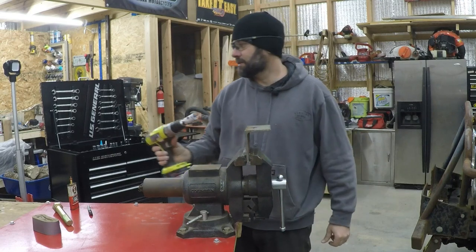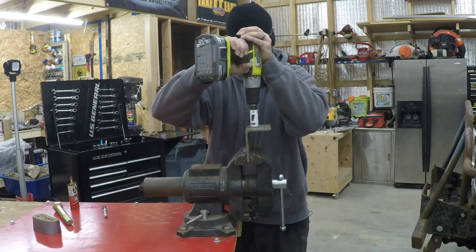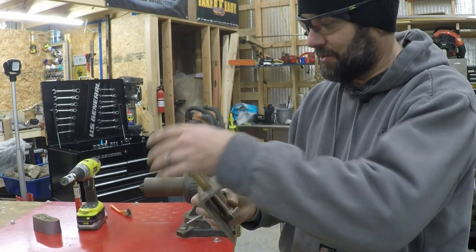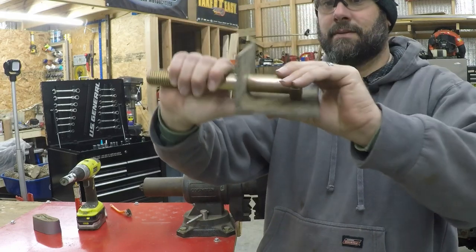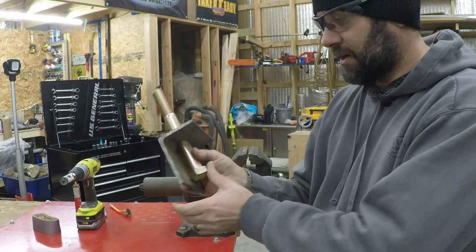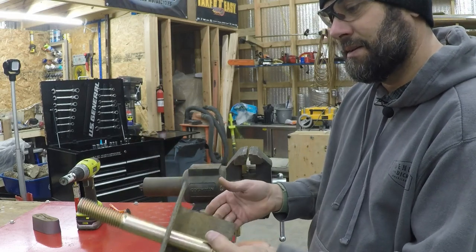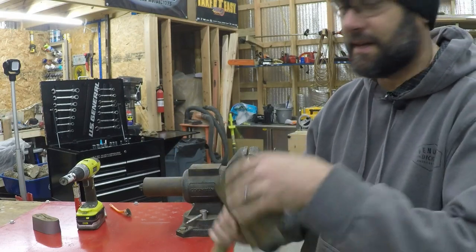It's not looking good so far — this bit's dull as hell. I went ahead and pre-drilled my one-inch hole, so we'll see how this goes now. I measured when I drilled my hole and tried to give it enough space where I didn't have to cut the head off the bolt, so it'll be pretty level. If I weld the bolt head to this angle iron and also to the bumper, I don't think it's ever going to go anywhere. This hole's in here pretty tight. If I weld the head of it, it should hold as well as all the bolts will hold. Now I've got to figure out how I'm going to mount it on the bumper.